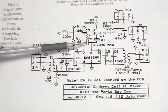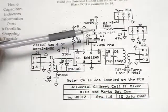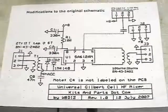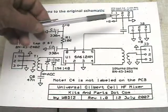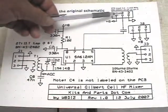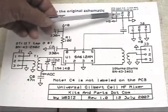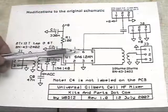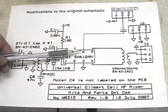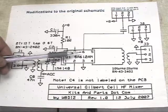I've changed mine and removed the internal oscillator circuitry, and I'm inputting an external VFO signal on pin 2 of the tune jumper. It comes down directly into a buffer inside the SA612, so I can run an external VFO.